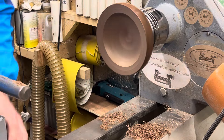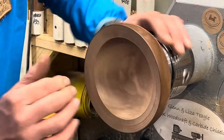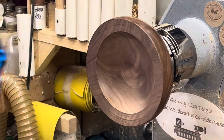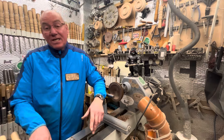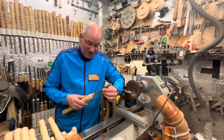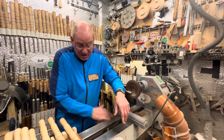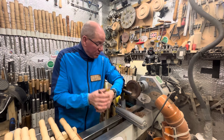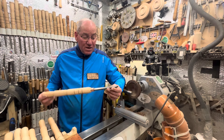That actually isn't a bad finish even just pulling out. But the one that gives the best finish cut is always the 12 mil - the SCH three. That's the chisel for finish cuts. If you're going to come back to pick up the cut, just let the bevel come back and it will find the piece. There you go - super smooth, all that torn grain is gone. Can you use these on the outside of bowls? Yes, but I don't. It's the Sheer Cut Hollower - it really is for hollowing.